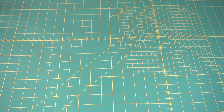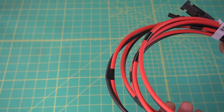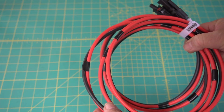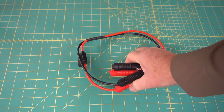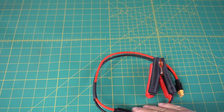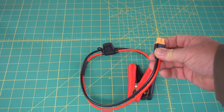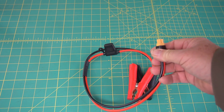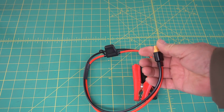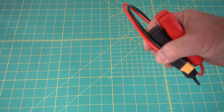I wanted to be able to hook this to my solar panels — I have more XT60 hookups than anything else. The controller didn't come with anything on the other side, so I added XT60s. I taped everything up because I don't like bare connections. I also bought jumper cables so I can hook easily to the battery. These are all 10 gauge — in retrospect that's a little big; 12 gauge would work, and these controllers are probably rated for 14 or 16 gauge. But you can make it work. One has a fuse on it, which is really good.